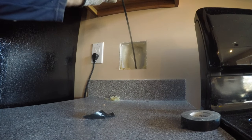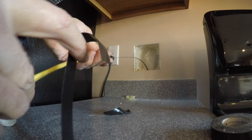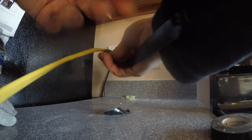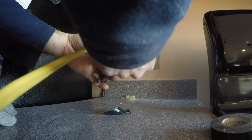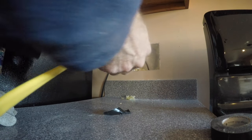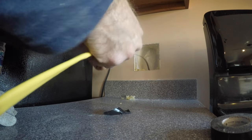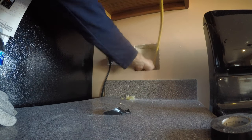This is the fish tape up above, and I decided to fish my wires from the top to the bottom. You can go either way. Whatever you do, use a solid method for connecting your wire to your fish tape. Typically, people take the ground wire, loop it through the hole on the fish tape, and then add some tape just so it doesn't catch up in the walls — you don't want to jam it up because you've got a relatively small hole the wires are going through.